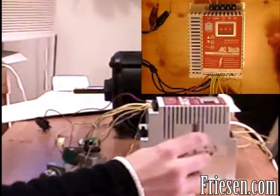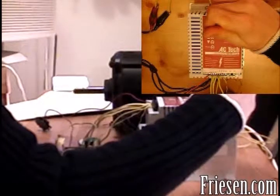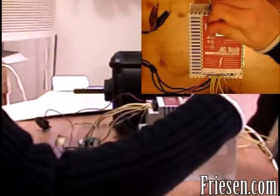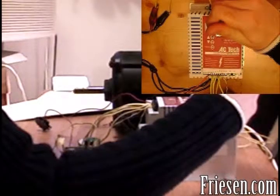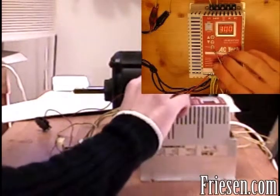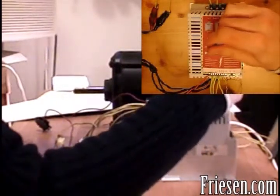Now that we have these switches configured to the drive, we need to set a speed that each one will control. That is done through parameter 31. I will be setting parameter 31 to the value of 60. This means that when I press the button connected to 13A, the drive will speed up to 60 Hz. We'll set parameter 32 to 30 — half speed. And we'll set a low speed option: parameter 33 to 10 Hz.